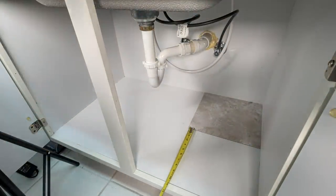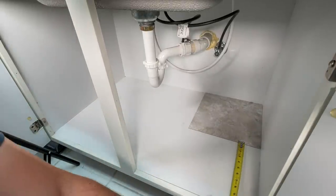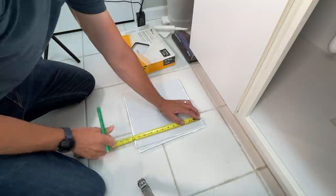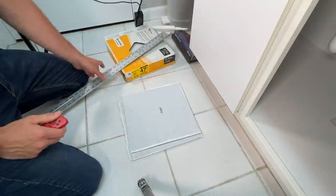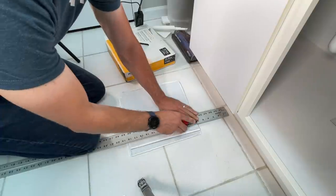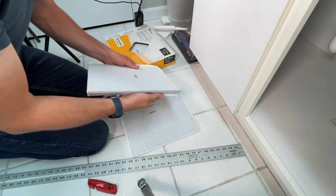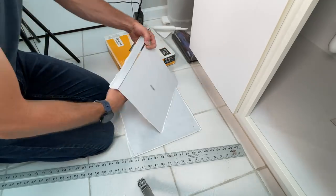Then I'll take my measurements because you will not be able to fit two 12-inch tiles — it's 10 and three-quarters inches. I'll measure on both sides, mark one side and then the other, and once I have my marks transferred to the back side of the tile I'll take a straight edge and a sharp razor blade and just score the back side. Don't have to apply too hard — and don't scratch your flooring. Then you break it and cut the front surface, and now you have your next tile ready to put into place.